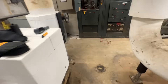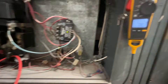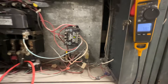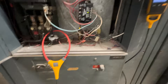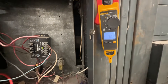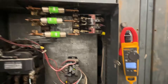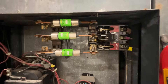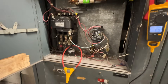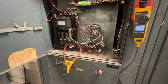Let's go ahead and check the other two legs. We're on load 2 - same, 78. Let's check 3 - and then 3, we're 77. So that's getting closer to it. But this may have a lot to do with what's going on there. I'm going to maybe throttle down on this pump a little bit to see if we can just bring that down. This appears to be fully open right now, so I'll just give it a little bit of a turn here.